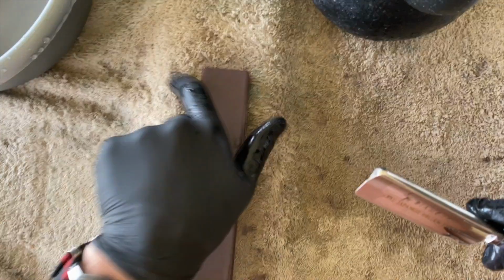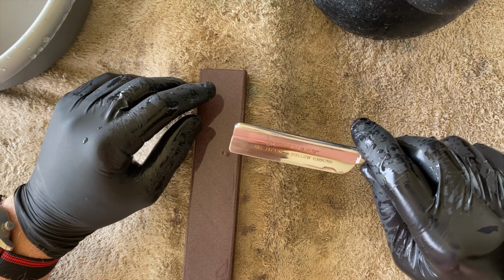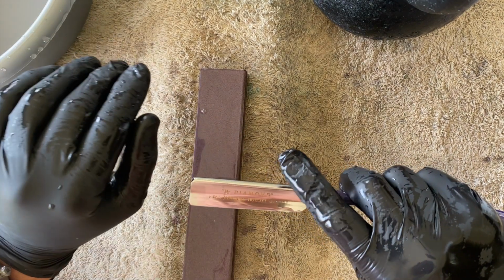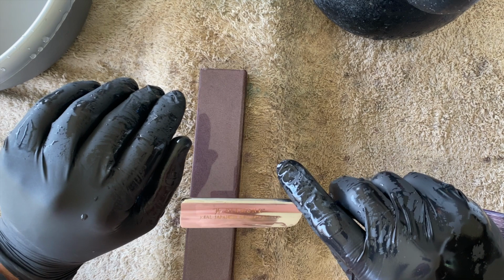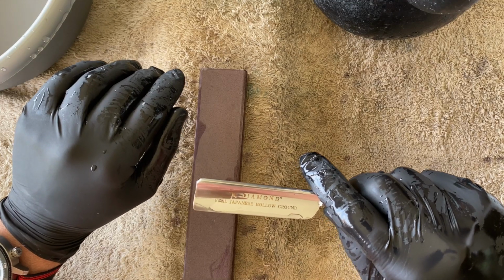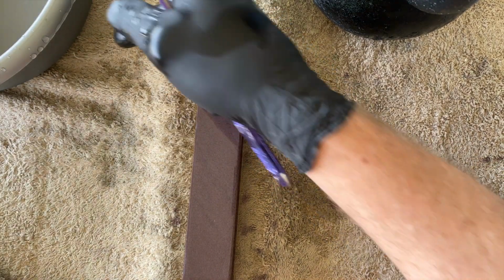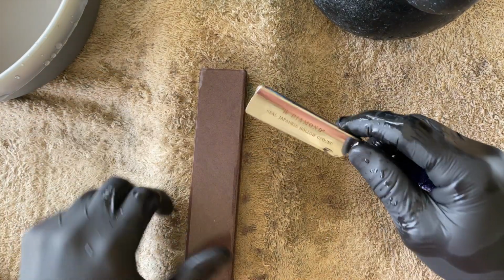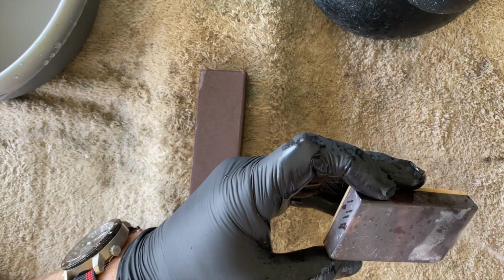I've got a bucket of water here next to me. I seldom sit at a bench and work. I stand at my honing station and do most of these things underwater, continuous running water mostly. So some of you have mentioned that there's still slurry and residue on my gloves, and does it not impact edge quality and so forth? And to be honest, no, it doesn't. But still, I want to just demonstrate that you don't need a lot of water. So I've just got this little bucket here with water in to do the bulk of the main rinsing. Right, moving on.